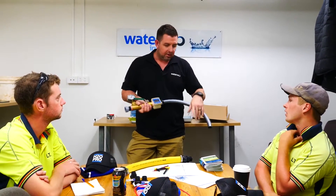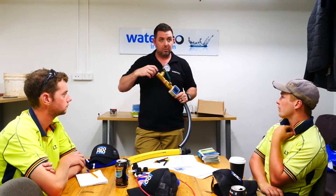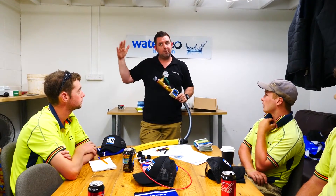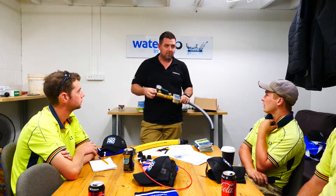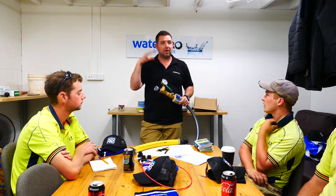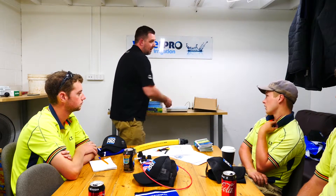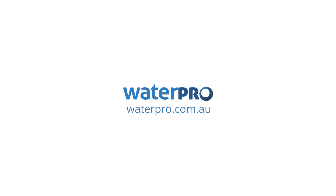That's the great thing about all the products we choose to sell — especially at a professional irrigation shop. If you go to Bunnings, Stratco, or Mitre 10, the sprinklers they sell are effectively two pieces of plastic with a slot cut in them and water comes out of it. Whereas a product like an MP Rotator or a Rainbird RVAN have wind tunnel data and testing — they put catch cans in a wind tunnel and test the millimetres of equivalent rainfall that these sprinklers will create in different scenarios.